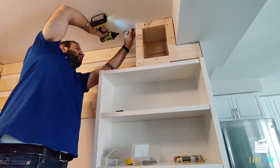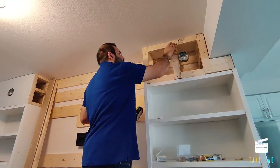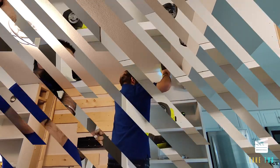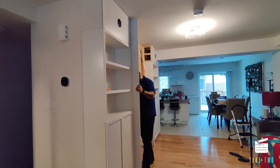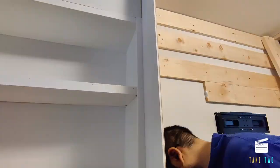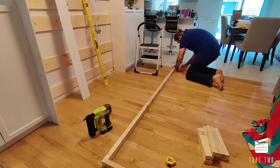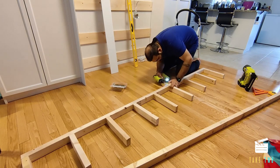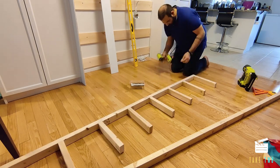All of these frames were screwed to the back on the studs to place them securely. We also used some more MDF to give a flush look. We wanted the fireplace frame to come out by five inches, so we used shiplap to measure that. Then we started making the side frames using two by threes. We first attached them with brad nailers and once they were done perfectly, we used construction screws to secure them firmly in place.